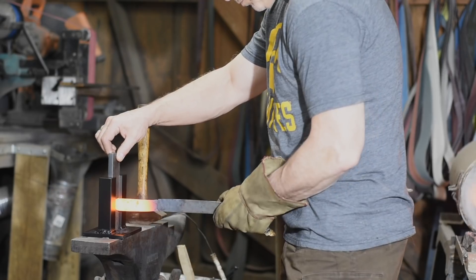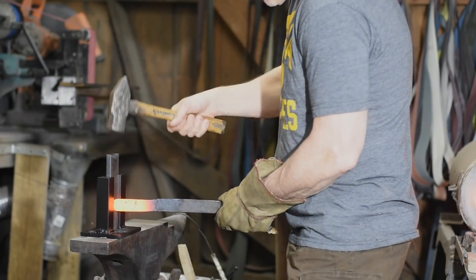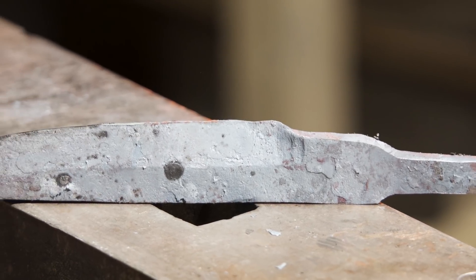So what is a guillotine? Not the thing used for chopping people's heads off. It's a tool used to whack little divots into steel. For blacksmiths, they can be used for necking hammers, upsetting small items, fullering, and various other things. For knife makers, the obvious use is in setting the little junction between the tang and the ricasso of forged blades.